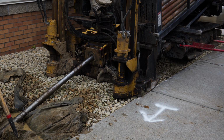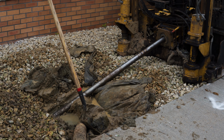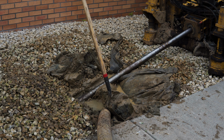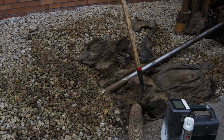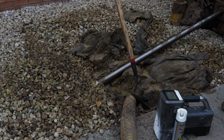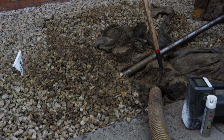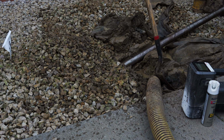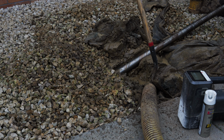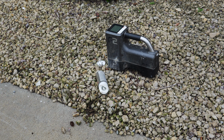So then we had to bring in some pretty heavy equipment to bore the electricity from the building to the signs. Do you remember exactly how far that was? It was a pretty good distance. Yeah, I think the one sign was 1,600 feet of cable, and I think the other one was 750 feet of cable. So there was a lot of wire that went in. Basically, we horizontally bored it in. We had them pull back 2 pieces of conduit, you'll notice here.